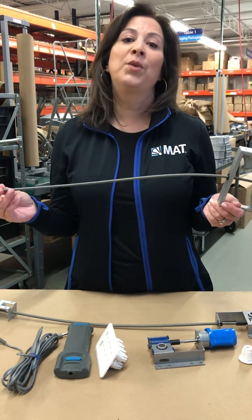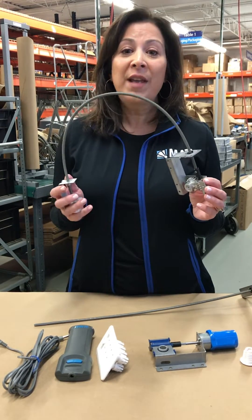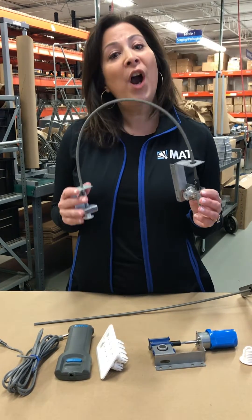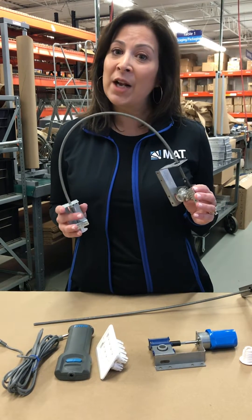The damper comes up to a 10-foot length of cable. For cable lengths greater than 10 feet, we recommend you use our Worm Gear Actuator. The cable with the Worm Gear can go up to 100 feet of cable, as long as you secure it every 3 feet with nylon clamps that we provide.